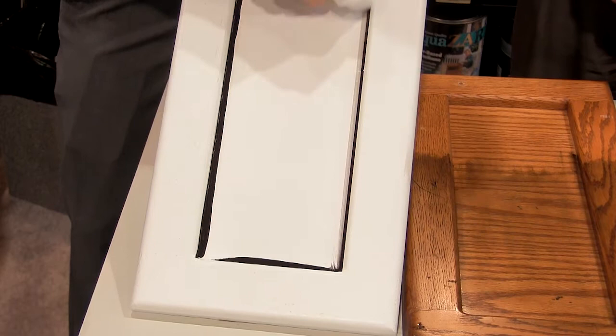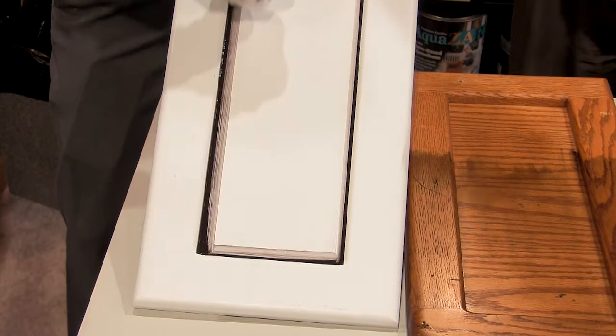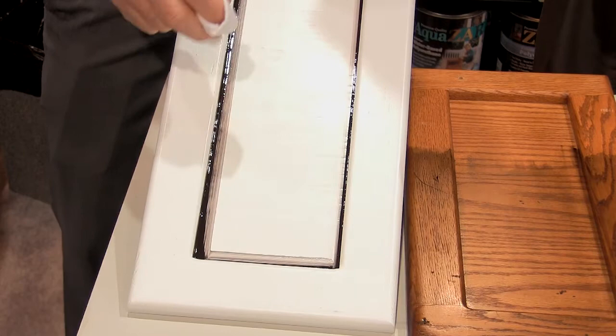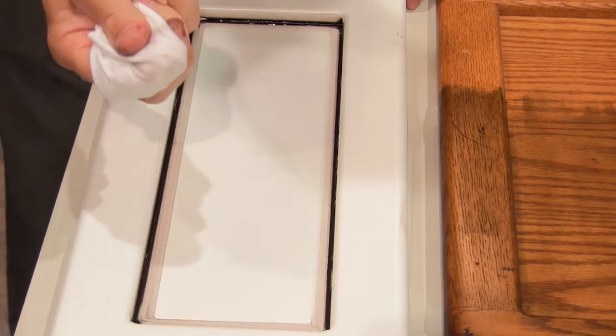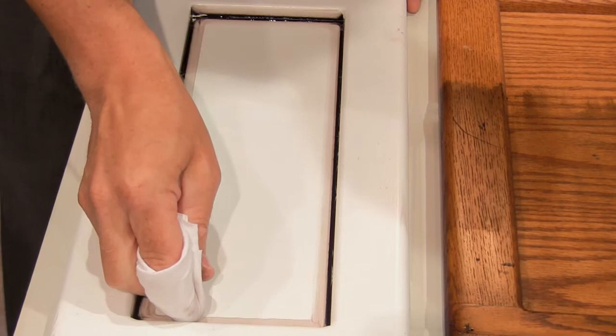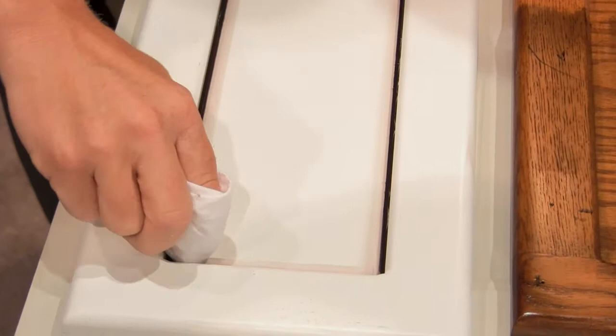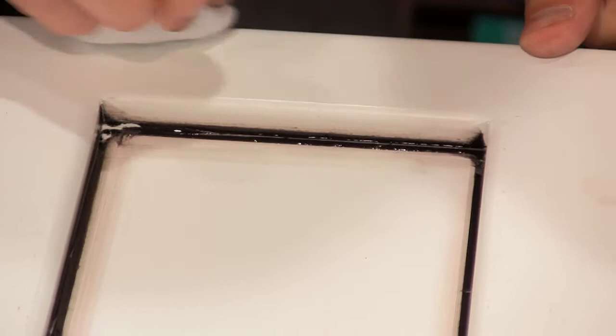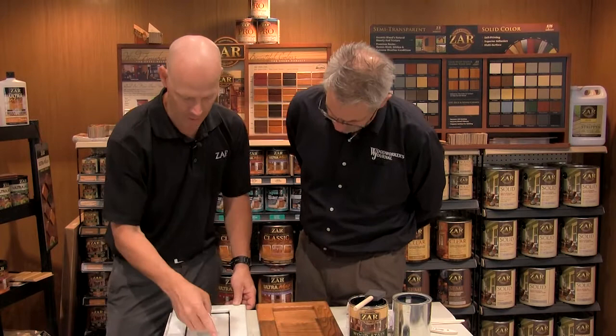So you're using what you just applied as a reservoir for the rest of the panel, or will you apply more stain to the whole panel later? You get to choose — you can apply it to the whole door and it'll accent all the distressed areas and the grain if there is grain, but here I'm just choosing to do the panel. Now I'm taking a rag with a little bit of mineral spirits on it just to wipe off the residual stain where you don't want it. The mineral spirits acts as a solvent — it just cleans it up nicely wherever you don't want any stain. What if you take away too much? Can you put the glaze back on? Yeah, you can put it back on — that's the beauty of this. You can start right over if you don't like what you see. You can just keep working this until you're satisfied with your glazed look.